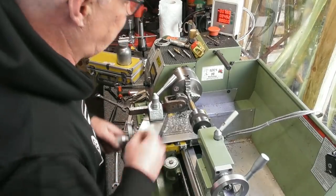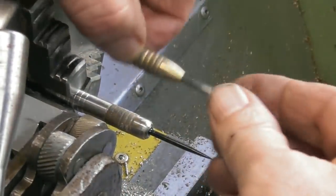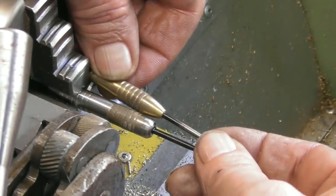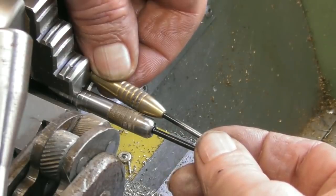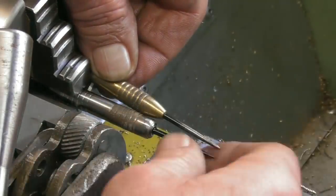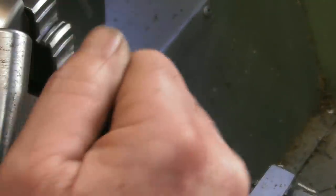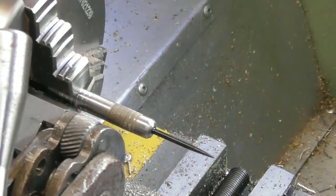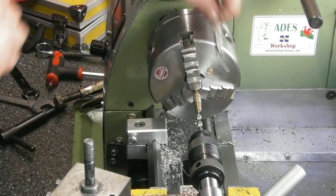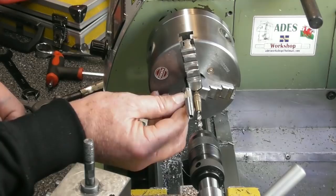I'll give you a close-up of what we've got. As you can see I've got a knurl on the end of there and it's matching up with the area where I'm going to need it — just about perfect. I think on the next one I'll just stick it out a little bit more. But yeah, I've pretty much replicated the same size knurl. You can see the little grooves in there left from the previous dart shape. So another two of those to do. Having done the knurl on the OD of the darts over the area where it needs to be — you can see the original darts are much much shorter than the ones I'm making from.